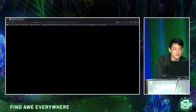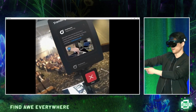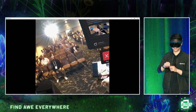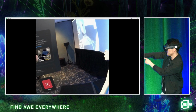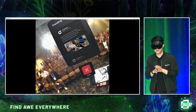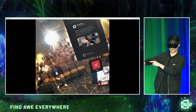So what I have here in front of me, as you can see right now, oh, there we go. On my watch is the Samsung Galaxy Watch 4, and what I have on it is our Doublepoint algorithm, which is able to detect the exact moment you touch your fingers together to select. If you just look at my wrist here, when I touch my fingers together, it seems to be able to detect it. It senses the vibrations using existing onboard sensors, basically the IMU and the PPG.